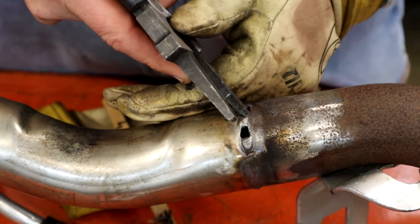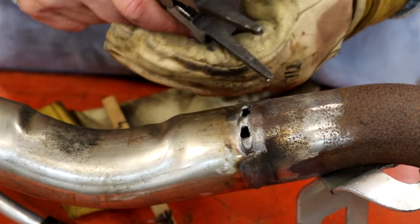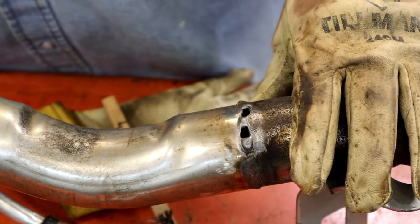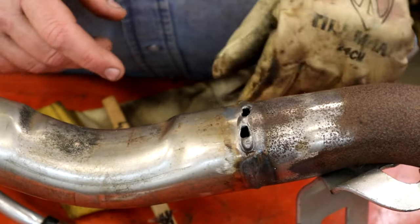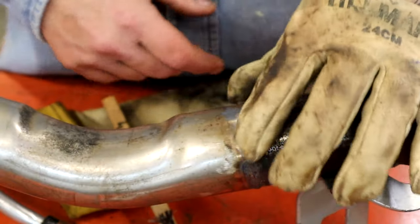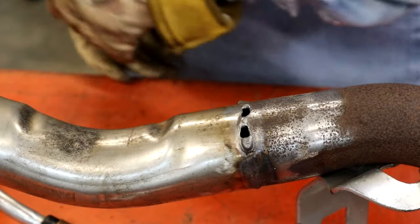So we'll come back here, and we're just going to get that crack, and we may have to work it around like that. Just watch what it does. Just tack it, and if it's not burning back away, you can just keep tacking. But you'll notice it'll get like a little oval shape here if it starts burning back too far. So we'll just go in here and bridge this back and forth and get that good, and we'll just knock that off with the grinder. And if you want these little stack looking welds, you can come back and grind it pretty flat and cut your wire speed back a little bit, because you're basically faking it, but don't tell nobody. Just lay it on top of that, zap, zap, zap, zap, like we did before, and we'll get it fixed. But yeah, I want to show you guys this, when stuff happens, you got to be able to fix it. It ain't all rainbows and unicorns around here, people.